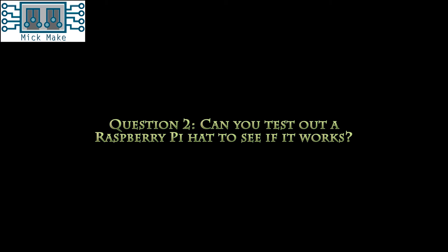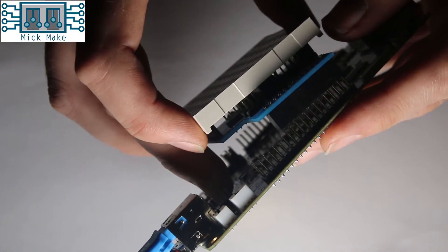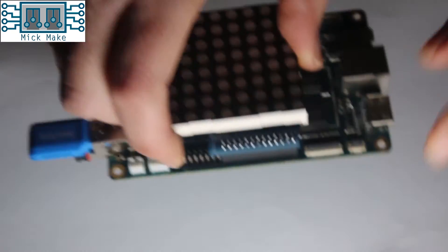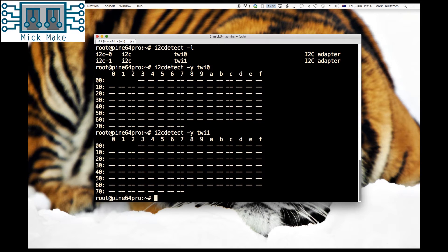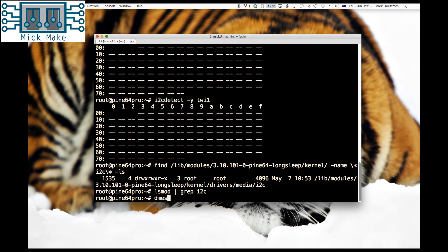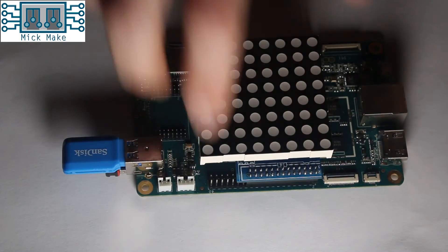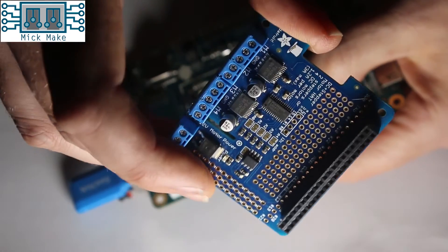Question 2: Can you test out a Raspberry Pi hat to see if it works? No problem. I first tried a Pi matrix hat that I had lying around — it's a nice simple I2C interface, nothing fancy. But as you can see, I couldn't see it on either of the two I2C buses. LongSleep didn't seem to build it as a module, but it was certainly built directly into the kernel. I then tried a DC stepper motor hat, just in case there was something fishy with the Pi matrix. Unfortunately, same result. I didn't bother to investigate any further. Frankly, as an SBC, it seems to be struggling as well.